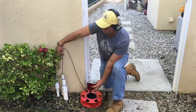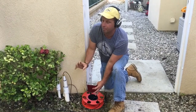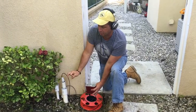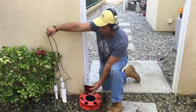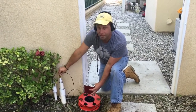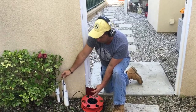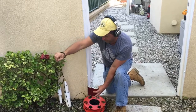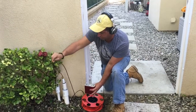Now what we're doing is we're listening on a very low volume, because when we get around that pressure-side leak with the pipe on the inside of the diameter of the pipe, it's going to scream. So we keep our volume very low, and what we do is we drag our microphone back at 12-inch intervals, letting it set, and we listen in between each. Some guys like to mute it in between each pull. If you have your volume down low enough, you should be fine.